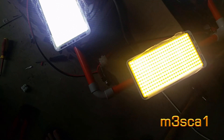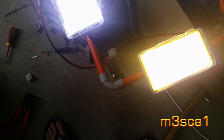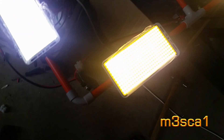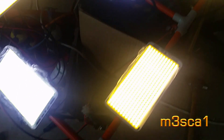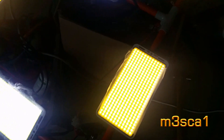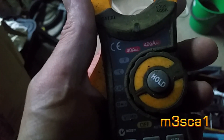I don't have any 20-amp fuses so I don't really want to go blowing anything. If I dial it up, they should draw enough current to pop the fuse — there's a 20-amp fuse in the PWM. This thing will peak at 30 amps for a short time. I suppose what I really need to do now is measure the current. I can't find my clamp meter — this one only measures AC. If I had more 20-amp fuses, I'd just dial it up until it pops and wind it back a bit.